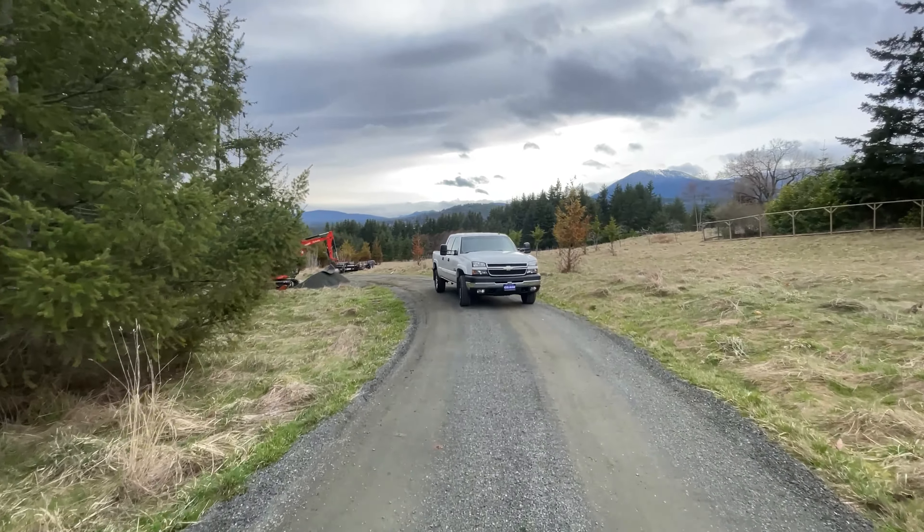Just got done laying 6 inches of 3-inch minus in the front, maybe 8 or 10 inches in the back — just to help reduce the fall, because the client's going to be parking their RV, that little Mercedes, on this pad right here where the excavator sits. I got my base rock down, graded out, and compacted with that little walk-behind. Now I've got 5/8ths, that's going to be the top course — that'll finish off this parking pad and make it smooth as butter.